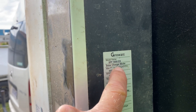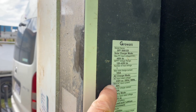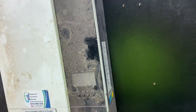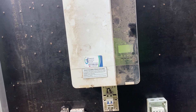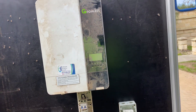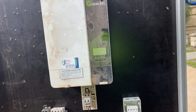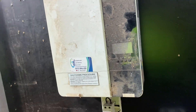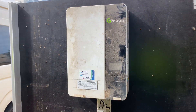This is the SPF 5000 ES, with an output of 5000 watts. The other thing to look at when reviewing specifications on a data sheet is the constant power output versus the peak power output. Some inverters, although marketed as 5 kilowatt units, can't actually sustain 5 kilowatts continuously — they may only do 3 to 3.5 kilowatts constant. That's something to be aware of when choosing a product to make sure it's correctly rated for your application. Hope you got something out of that — thanks for watching.